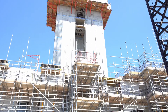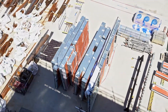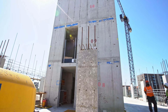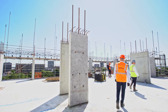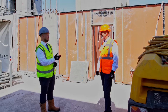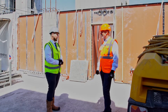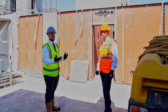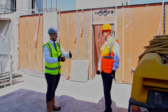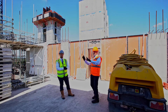We're up here pretty high — this means people would normally be on the outside of the building on scaffolding, hoisting windows with all the movements that have to happen. This went from the manufacturing facility to the job site, picked by a crane, put in place — it's like magic. We'll get up to three apartments' worth on the trailer. Our best lift time is about six minutes from the back of the trailer into the opening — we average about 15 minutes. So you'll get through an apartment's worth in about two hours — completely done, completely compartmentalized, internal walls, external walls, ready for the concrete shuttering. And there are 1,100 apartments in this whole complex.